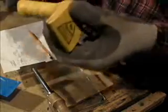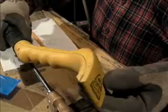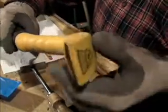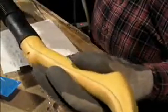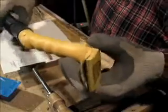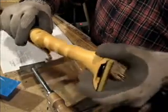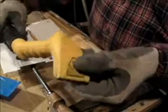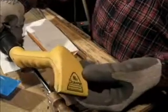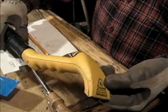And I did that with the vacuum scraper. It has a sharp steely edge and a hollow handle that's attached by a hose to a HEPA vacuum. So that's a real nice scraper just to do that final cleanup, because it's a dry process, so it's good to catch all that fine lead-containing dust. The Pro Scraper. If you've been to my training sessions and workshops, you've seen that in action.